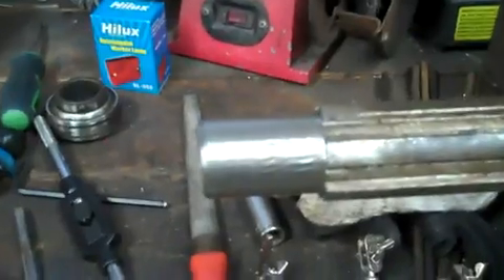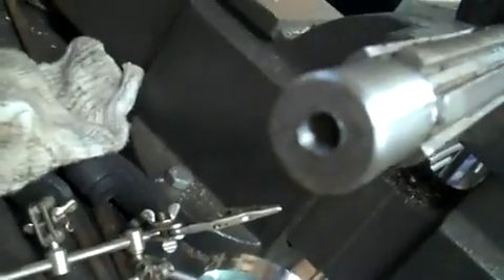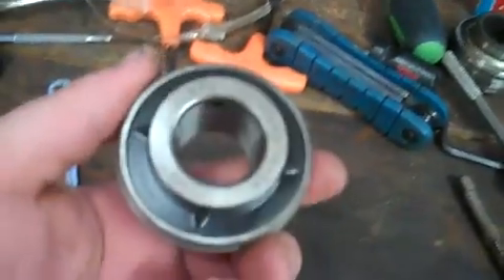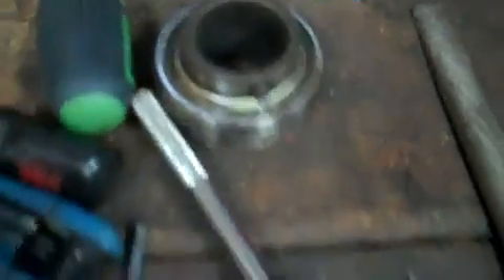I was getting a little tired of tightening grub screws and whatnot, so I set up my lathe and machined down the end of the original axle. You can see there — I drilled and threaded a hole, and I bought the new style bearing, which is basically a 206 but with a 1-inch bore. And you can see there's the bearing that came out of it.